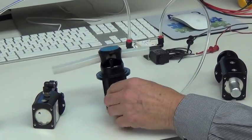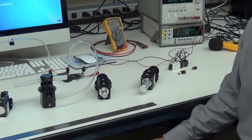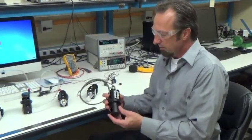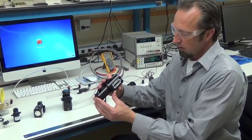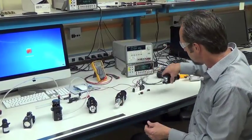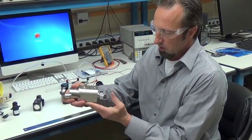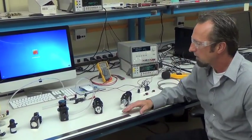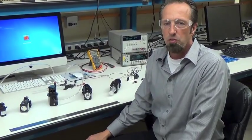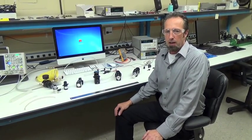That's a basic overview of valve operation. Our pneumatic line comes with several standard options. One being state sensing — this is an example of a digital pulse sensor attached to our model 935. We can detect open or closed end of stroke. This is also a model 935 in all 316L stainless steel with a micro switch type sensor attached. That concludes the general overview of features and operation. In the next segment I'll be going over noise level of the product and how to contact us.